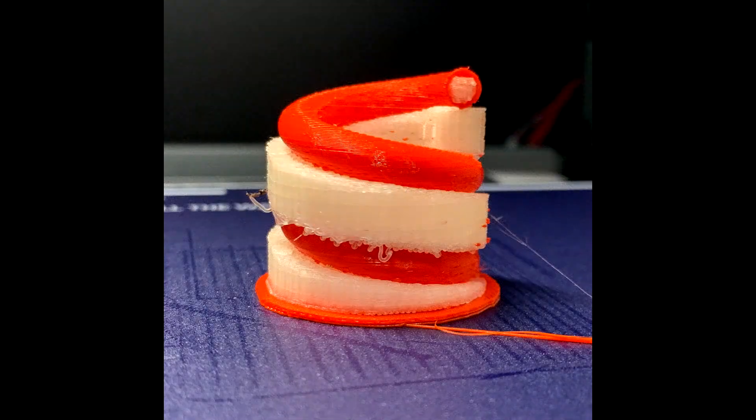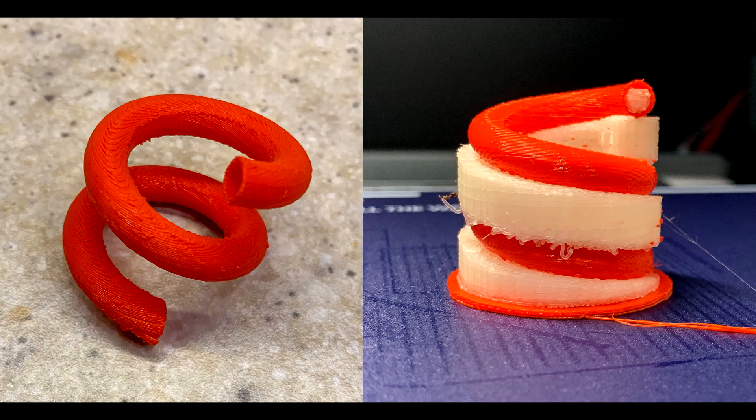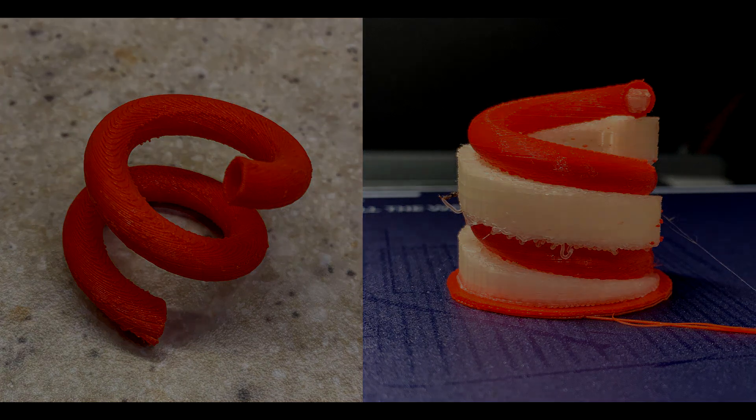You need to use warm water to break the PVA free. You need to make sure the head and nozzle is appropriately Z-gapped before you start, and only use the optional PVA nozzle when printing PVA material. Using a wipe tower or prime pillar is also recommended. But there are some models, like this one, where water-soluble support material is a necessity, and the 3DWOX 2X seems to be up to the task.